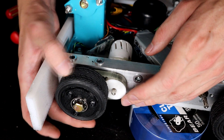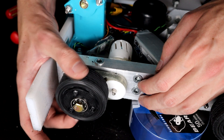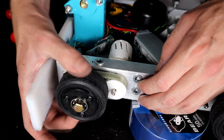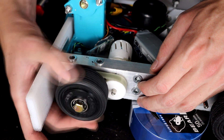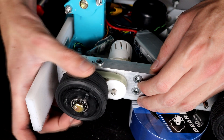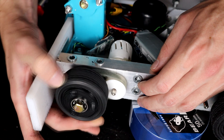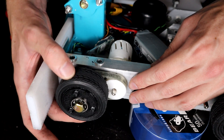That was going really well for a second, but now one of the drive motors has stopped, and we need to check that out for sure. I am so confused as to how this has happened. This here is the problem wheel — it is the front left wheel, and you can see that the pulley here is moving but the shaft is not moving. It does pick up occasionally, but it's got a whole lot of slop in it. We've slipped all the way around and there's a huge amount of slop now. There is no way that should be able to happen with the bolt in here, so we need to grab this pulley back off and see what's happened to our poor bolt.